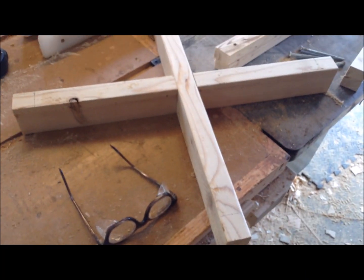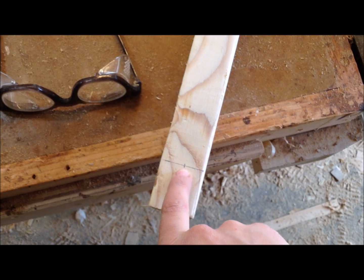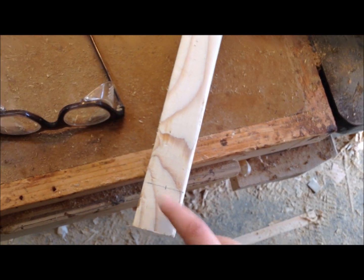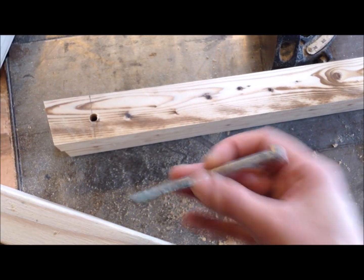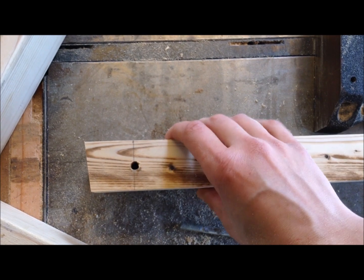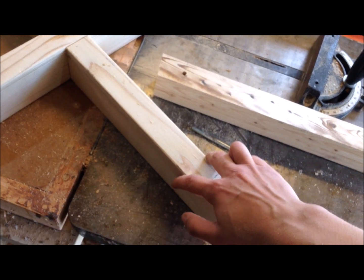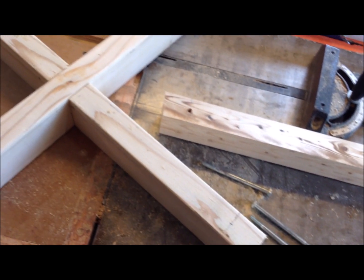Before putting this together I need to drill some holes. On the edges I marked in about an inch and a half and centered at three-quarters, then drilled half-inch holes there for anchors — tent stakes or spikes — to go into the ground. For the arms I'm drilling a 9/32-inch hole to fit the four-inch bolts that will connect them to the base, coming down another inch and a half, centered at three-quarters. I stacked the pieces and drilled both ends at once on the drill press, then used a hand drill to drill through the base so all holes line up.